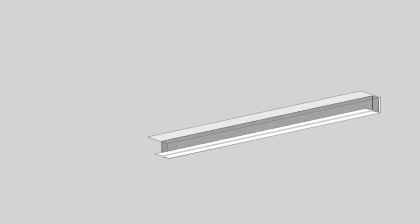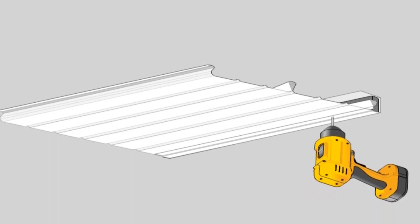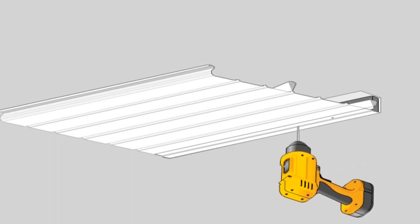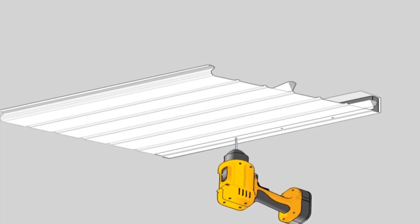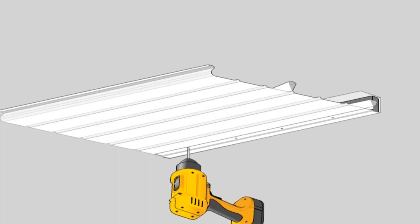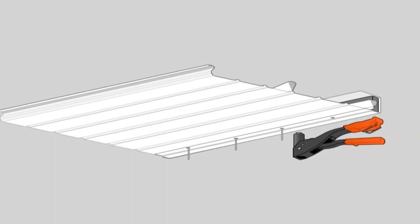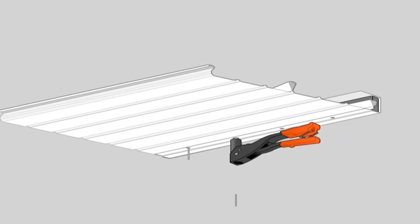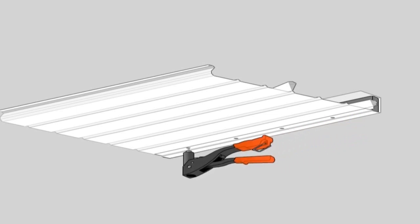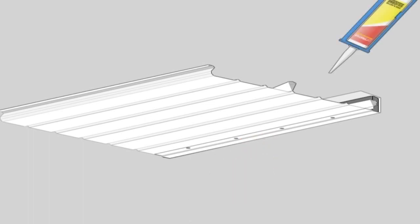If sheets run parallel to the back channel, the first roof sheet is slid into the BIP foam in the back channel for a weatherproof seal. Sheeting is secured with rivets at 500mm centres to the back channel and hex head screws at 500mm centres to beams running parallel with the sheeting. Roof sheets are fixed as standard to supporting beams. In cyclonic conditions, three 12x20mm hex head self-drilling screws are required per pan to supporting beams and three rivets per pan at the back channel.